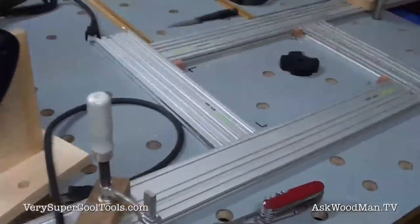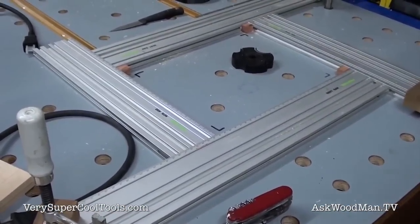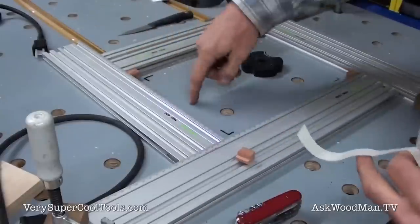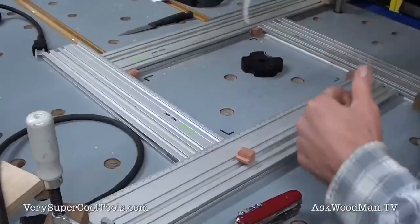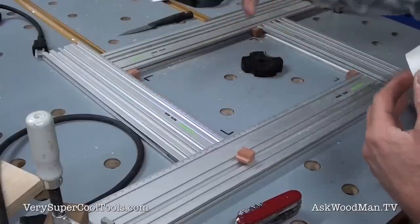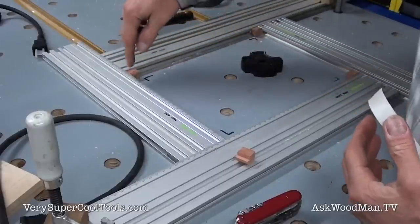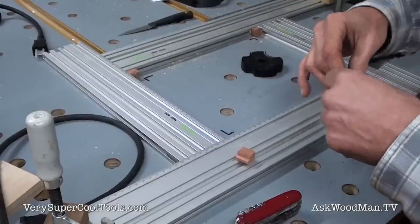Here's what I'm going to do: when I route this, I just cut a few of these pieces on the table saw. The bushing guide is going to hit that and stop me from cutting into these corners. I'll cut to depth and the whole nine yards. Then I'll take the jig off, take the template off, come back in, put the actual thing down into position, scribe into the laminate, and just freehand with that bit because I'll have very little material to remove.